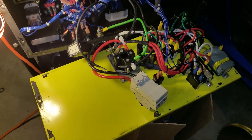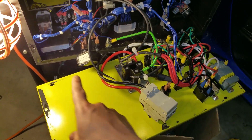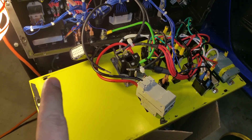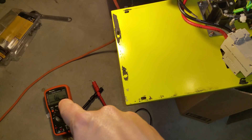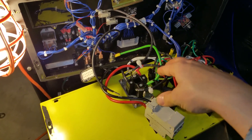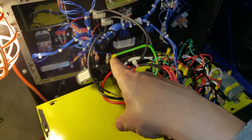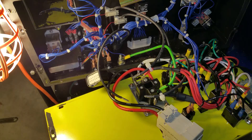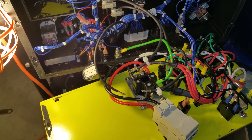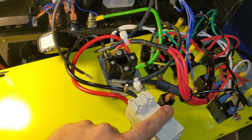Going through with my meter, none of the phases and none of the windings show continuity to ground, or if there is continuity it is a very high resistance that my meter cannot measure — that's a good sign. This was after I isolated all the main windings from the stator. If there's no insulation breakdown to ground that's good, but it still doesn't necessarily fix the problem, so I need to dig in further and start with the simple stuff first — making sure the hots and their splices are connected back to the main circuit breaker with tight, clean connections.